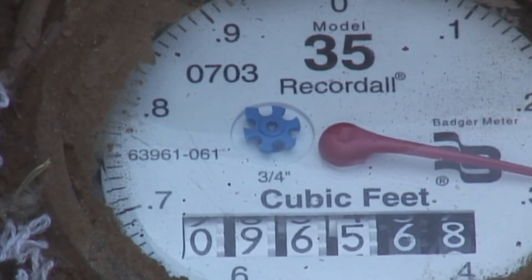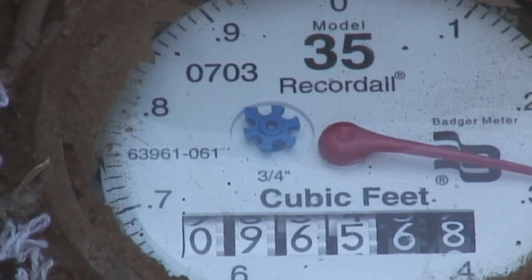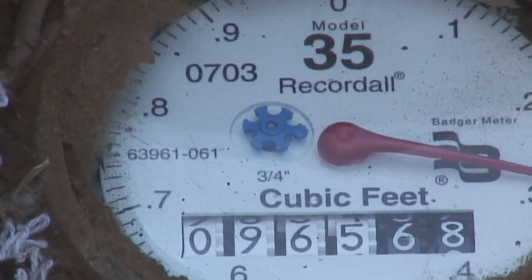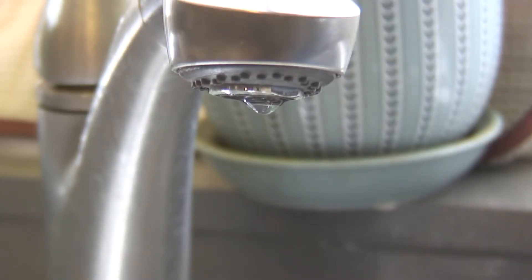But now let's turn on a little water. Look at what happens — the meter starts to spin. The indicator moves slow for a trickle, faster as more water flows. Because it's mechanical, the leak indicator has its limits. A drip, drip, drip like this will not be detected. But if it's a constant stream of water where you don't see any break between the water droplets on a faucet drip, it will show that.